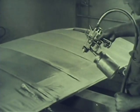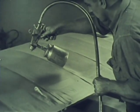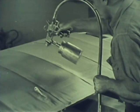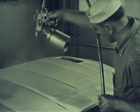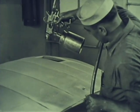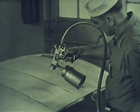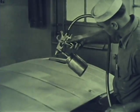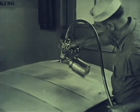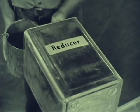If a run does form, the trigger of the gun can be pulled back halfway to release air only. A gentle stream of air played on the run will soon dry it. Too much air will spread the run. If the gun is held too far away, the dope dries before reaching the surface. This produces a dust-like finish called orange peel or pebble. The operator corrects this by holding the gun closer to the work. Another cause of orange peel is moving the gun too fast; moving the gun more slowly will correct the condition. Not using enough thinner will also produce orange peel.